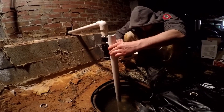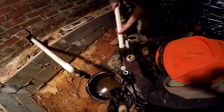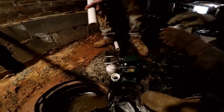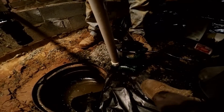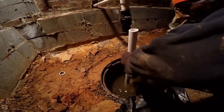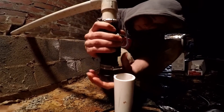Make a good cut — it's going to be right at the top of that coupling. Make a good mark. Now we're going to glue up the riser and stick it into the male inch-and-a-half threaded discharge of the pump. Keep it down at the bottom. Stick it down into our discharge section, push it, twist it, set the pump down into the pit, and line it up perfect.